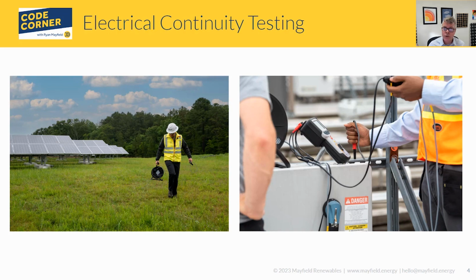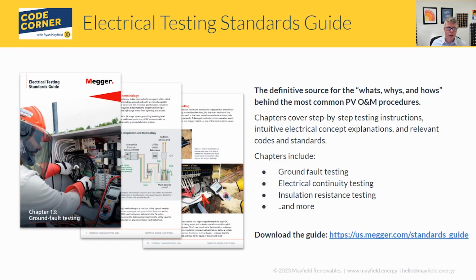They're also useful for the contact resistance of your electrical terminations, which was mentioned in that table in 70B. So this tool can be used to verify your terminations. This is, I would say, a more traditional use of the tool in the electrical industry, verifying that the termination points have a low resistance. You can use it to measure the contact resistance across those and make sure they are of low resistance. So if you're having issues, or you're in a maintenance mode, these DLROs are a great tool to utilize to verify that you have good low resistance contacts wherever you have electrical terminations.